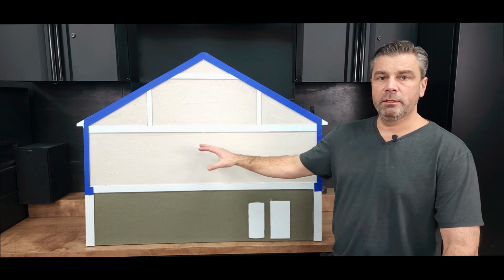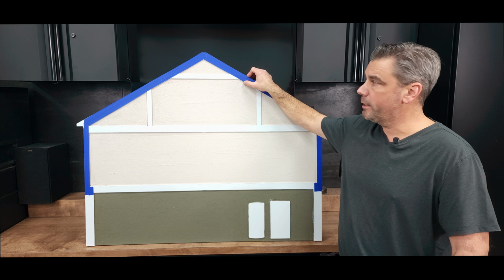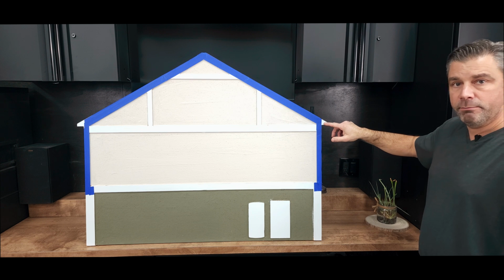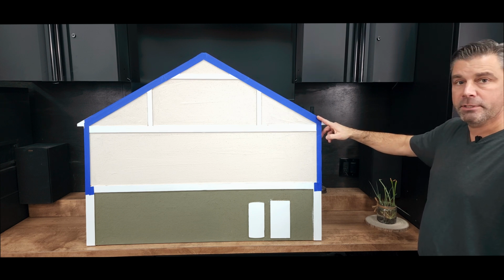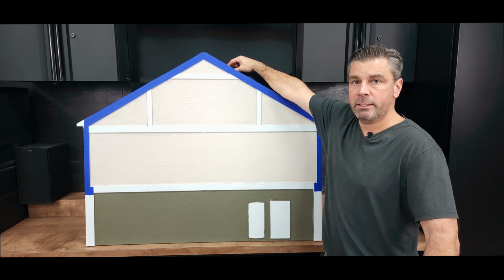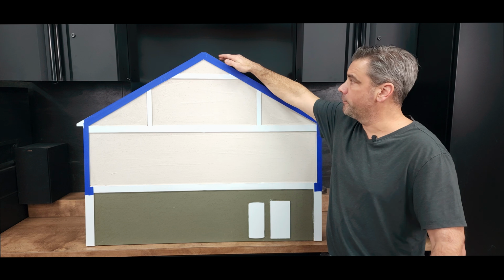So does that mean I could do something like this? 100% yes. So if we're going to spray foam this slope with 4 to 6 inches of closed cell, or maybe more if the rafter depth allows that, what we would do is we would block your soffit vents off completely. We would build off the top plate of this wall and connect foam right up to that roof line. Then run that roof line straight up and block off any of the old roof box vents that may be existing. Along with that, any ridge vent, so really any ventilation is being blocked off in full.